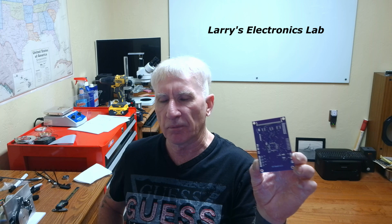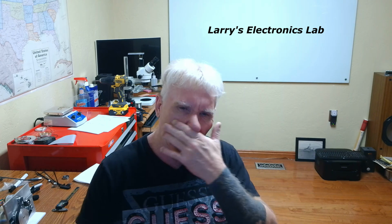because one thing I wanted to mention too is the old way to do it would be, before you order the PCB, you would prototype the board. As cheap as these PCBs are now, and Fusion really makes it so you make fewer mistakes, because it links the schematic to the PCB. So there's not really much of an incentive, especially with surface mount, to prototype the circuits first now, because you can order a board pretty cheap, and Fusion is pretty accurate, and you don't make a lot of mistakes. So the only thing would be if your design is flawed, then you'll probably have to cut some traces and add wires and stuff, but you still have a board to work with, and it's clean.